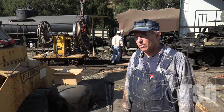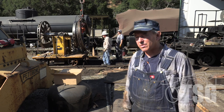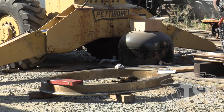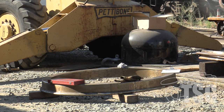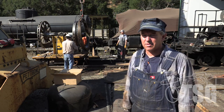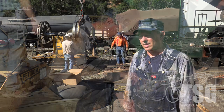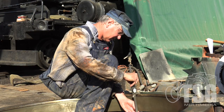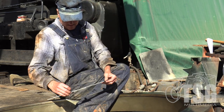These tires were ordered and they came from back east. They need to be rolled — they're steel ingots — and they roll them into an iron wheel. Once they're to the proper dimension, they machine them to the final dimensions that we need. We measure the diameters of all the driver centers after they were machined, and then there are some other dimensions that we need to get.